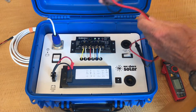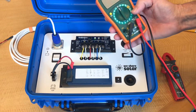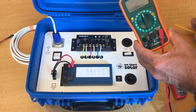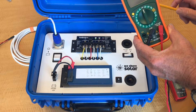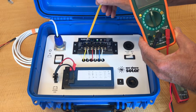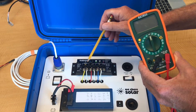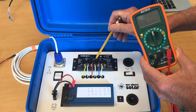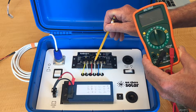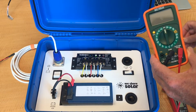This is the digital multimeter. We will use this to measure the voltage of the battery and the solar panel. We can get the voltages by putting the probes of the multimeter on the terminals on the charge controller. Over here on the left, these two terminals correspond to the solar panel — the yellow and the white. Next, we have the terminals that correspond to the battery — the red and the white. And finally, the blue and white terminals correspond to the load values.